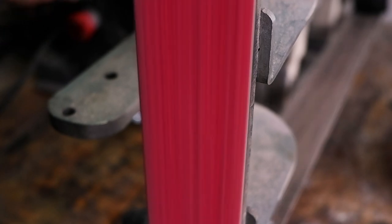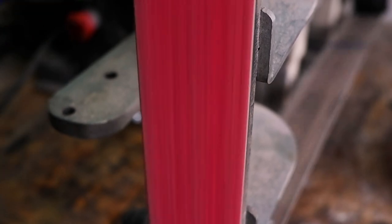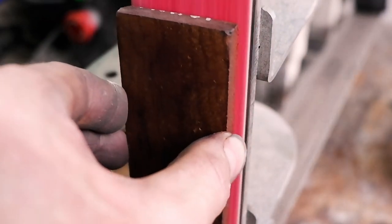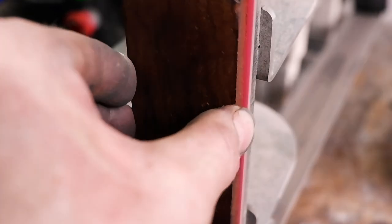Clean up the surface of the wood and bevel the edges of the pin slightly. Sharp edges on the pins will carve the holes in the wood larger after a couple of fitting tests. We want to avoid the pins being too loose.